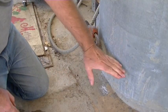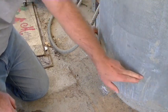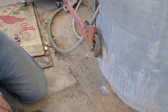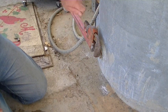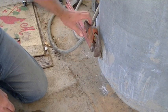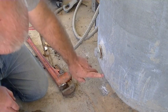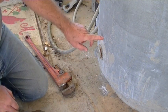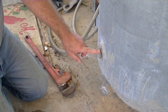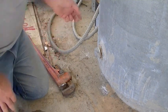We have about that much sediment built up in this tank to the level of where the outlet is, and that sediment's getting worked up every time water comes into the system — it blows it around and it's just too much. So what I'm going to do is open up this plug here, which is about four inches up, so it'll be the water level — typically the outlet's about right here. I'm going to use a PVC piece of pipe to stir it up while the pump is running.